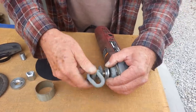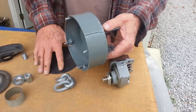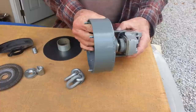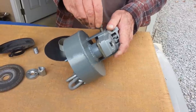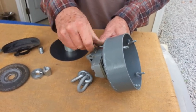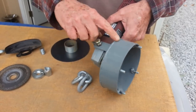What you're trying to develop here is something that doesn't swing with a lot of weight out here with all the pillow blocks and bearings and everything else. So what you'll end up with is a piece like this when it's all done. This is the flat stock here, and this will be the sleeve that goes on top of this. The way it goes together: you'll end up going this route, using a nice bolt on there. Don't just use a nut or just a bolt by itself — do a bolt with a lock nut, and you don't have to worry about threads or anything. What I've done on this one is basically used a piece of two-inch flat stock, eighth inch to keep it lightweight. Cut out 18 inches around and welded it up on the side here, making it a two-inch swing on the thing.